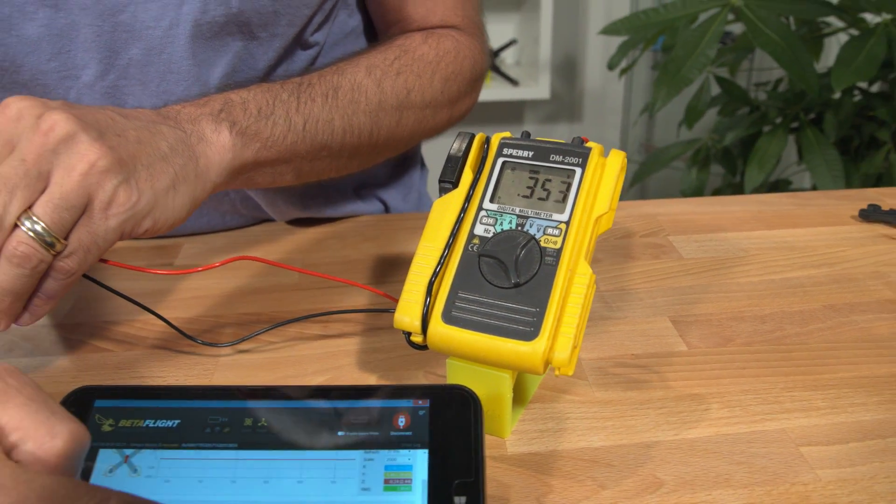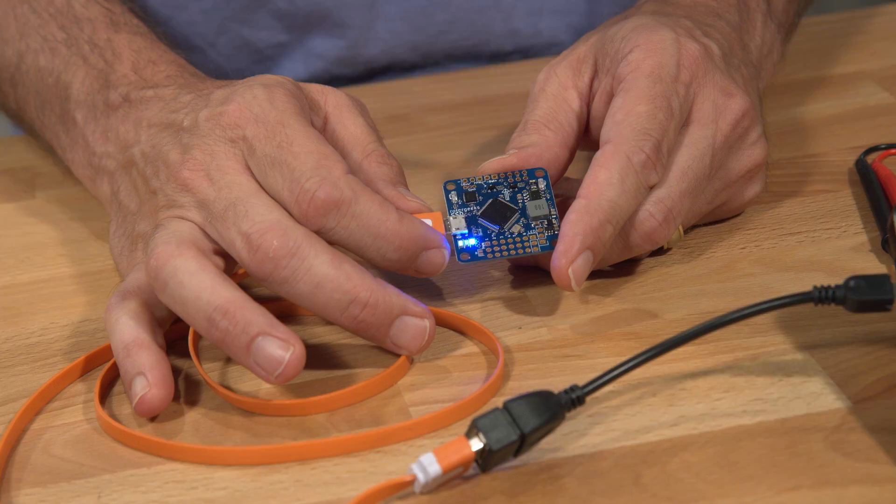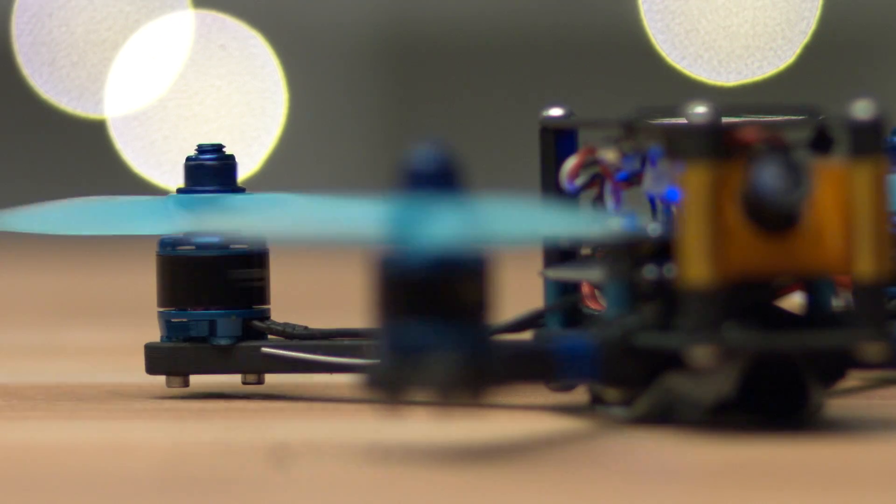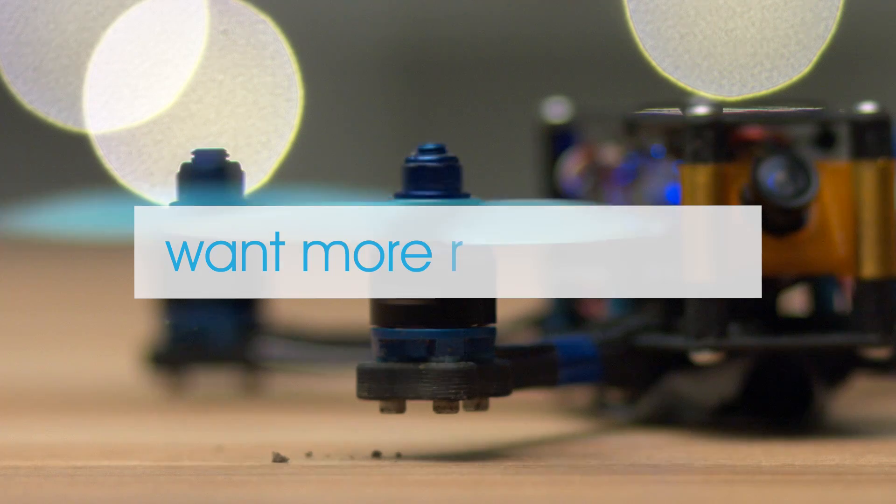My guess is that in the communication of a long stream of ones as opposed to zeros — which is what's going on when we're at full throttle — those ones are carrying a high signal averaged out by the multimeter to be a higher voltage level. You can use this technique to troubleshoot any flight controller and any ESC protocol. I hope you found that helpful. Thanks for watching. For more tips and tricks on troubleshooting your quad, subscribe to the channel. Good luck.